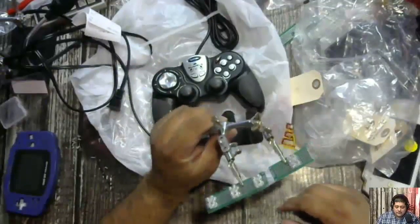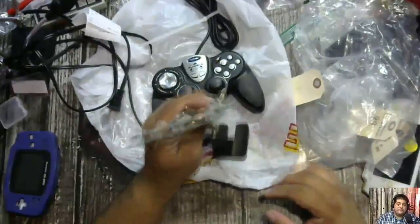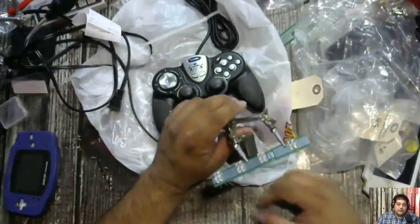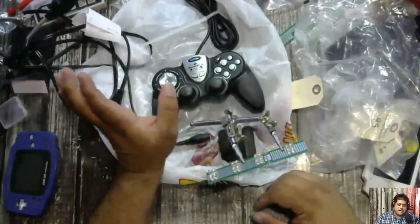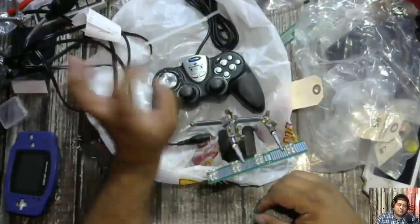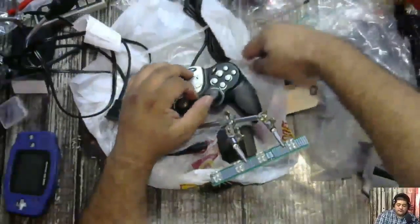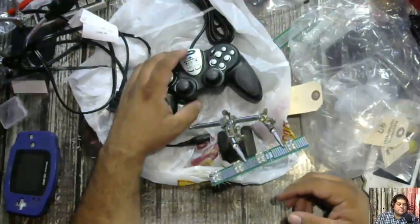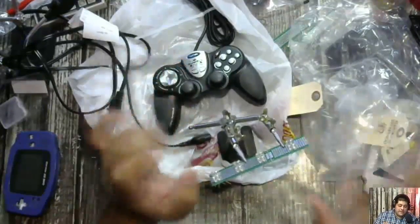So, this is one of two parts. This is the beginning of the Bowman light bar that I'm going to be building for him for Father's Day to use in his car using LEDs. And so it's going to be a four channel color organ. Usually the Bowmans were only 3-channel, and one of the colors was yellow on some of the bars that I was looking at. And what they did is they just swapped one of the other colors with yellow just to give it extra color. But the way that the circuit that I'm building works is it triggers LEDs on a transistor by filtering out audio and only triggering on certain frequencies to make the lights flash.